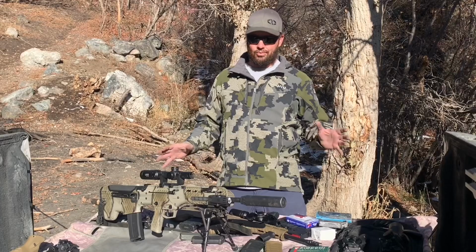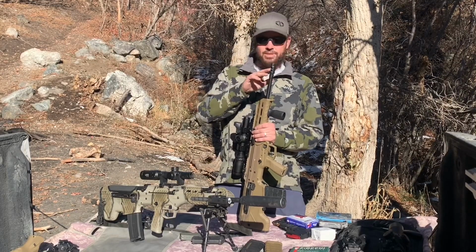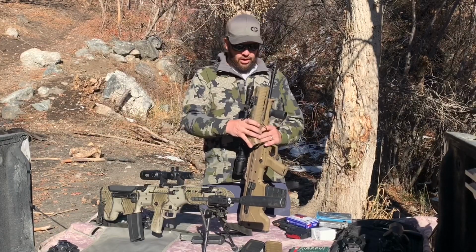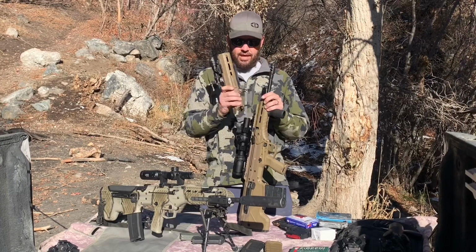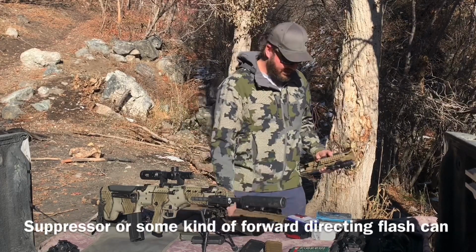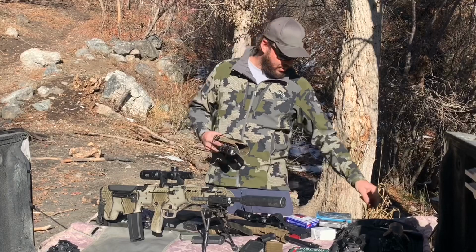One thing we will want to mention when it comes to muzzle devices, you'll see here with this handguard, the compensator is quite a ways from the handguard, so it's not an issue. With the longer handguard, you'll recall it was also sticking out the end of it. Now, if you had a 16-inch barrel in this rifle, this is a 20-inch Creedmoor right now, but if you had a 16-inch barrel and installed this handguard on it, the muzzle is going to be down inside here, which is fine if you're going to put a suppressor or something else on it. But the last thing in the world you want is to have a muzzle brake or compensator that is down inside here. This is just plastic, and it will blow it apart, and you could have not only a damaged handguard, but you could have an injury there. So keep that in mind.